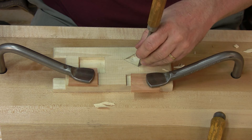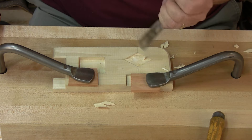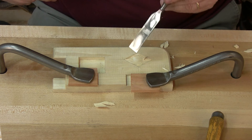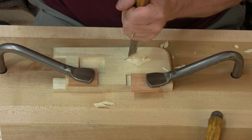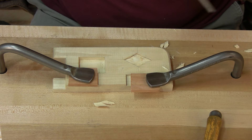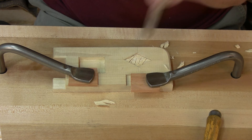So I'm going to need to go back and flatten this out a little bit. The other thing you want to be careful of is that the sidewalls of your chisels don't dig in when you start paring into this corner — you don't want to bugger up that outside edge. You're going to have to learn how to twist and maneuver your chisel to get into those corners without binding on the sidewall. I'm still undercutting just a little bit, so now I'm going to take a couple of quick relief cuts. In the areas that I'm thicker or higher, I'm going to take a slightly deeper chop and then go back in there.